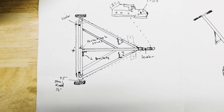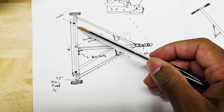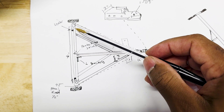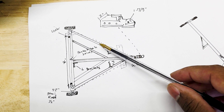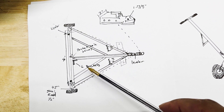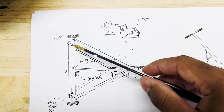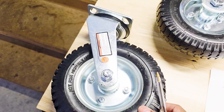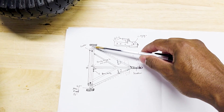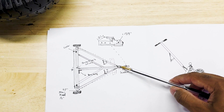Here's a rough draft of what I'm trying to do. I'm going to have my telescope tripod with two doubled-up two-by-fours going this way, and then like a T, two two-by-fours going that way. I might add that inner one as well for maximum stability. I'm going to use these big eight-inch casters, with two stationary wheels in the back and one swivel caster in the front.